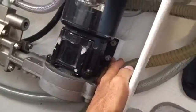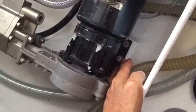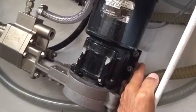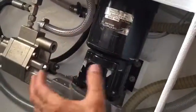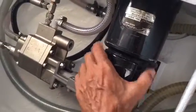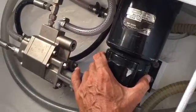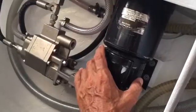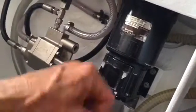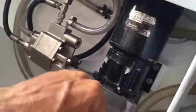Hope you enjoy it. First thing we'll do is come inside and give you a quick run through of the water maker and how it's set up. You can see our water maker is mounted directly to the hull. It definitely creates more noise mounting it that way. It was previously mounted with rubber isolation mounts, but we found that it moved quite a bit and we didn't like it. The difference in noise between hard mounted and through the isolation mounts isn't that big a difference.